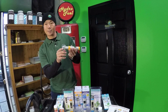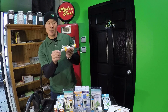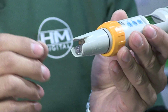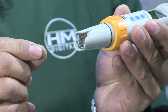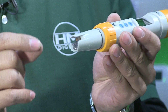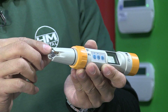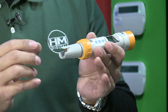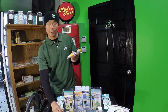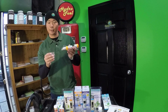You'll notice that the glass sensor has some fluid in there, which is actually a potassium chloride gel. The glass is semi-permeable so that in order for the pH sensor to be working properly, a little bit — a few molecules of the gel — will seep out to communicate with a reference electrode, as you see on the pink sensor. Therefore, it needs to have a constant flow of this gel, and you need to keep this in equilibrium by keeping the sensor moist in this sponge-filled cap.